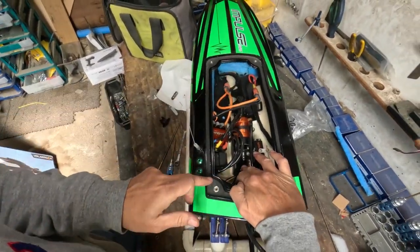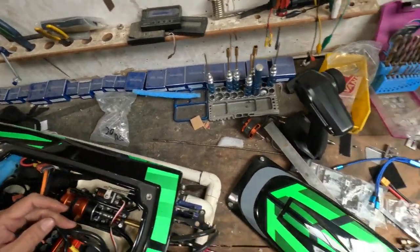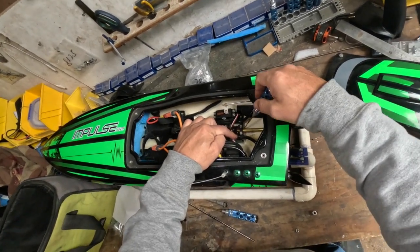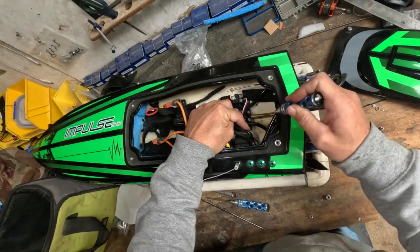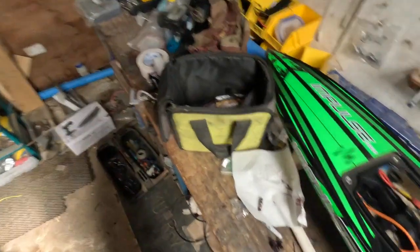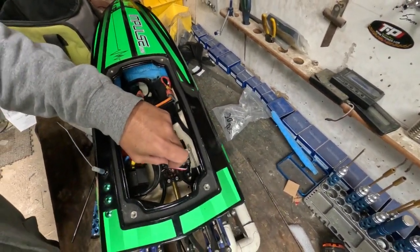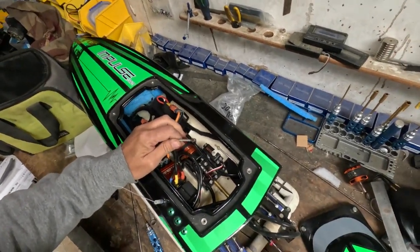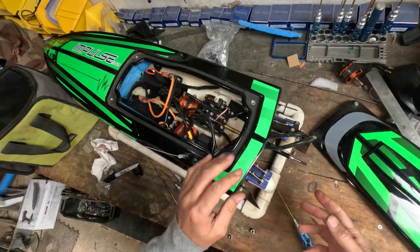You might not be able to see but it's sitting too low. It needs something to lift it up, like a hook. Ideally I would raise the stuffing tube up a little bit by spacing it from underneath. I'd already done that when this was new — you can see that little black thing there, that's a cable tie I put on there to make it higher and closer to straight. You could probably use another one to lift it up, but I'm just going to use the head of a bolt to raise it and guide it in. There we go — if I was ultra fussy I'd fix it properly, but I know this will work. So that's right in there, now I'll put my drive dog on.